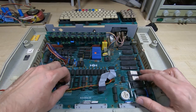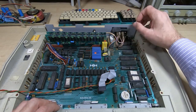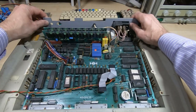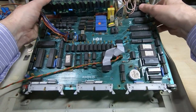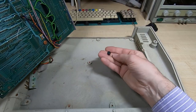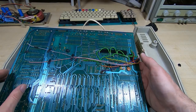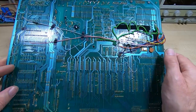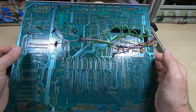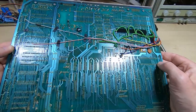I can see there are a lot of modifications made to this. I'll pop the board out and we'll have a look on the underside. That's perhaps even worse than I was actually expecting - got some bits that have simply fallen off, and an awful lot of modifications have been made. We've got lots of little jumper wires, a lot of corrosion down at the front end. There's been a lot of work done on this - I can see almost half, at least half, of the pins have been retouched at some point.